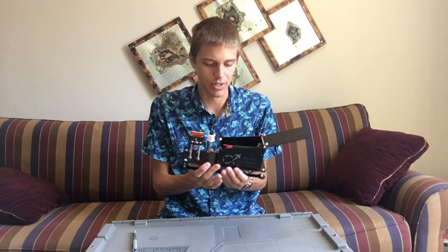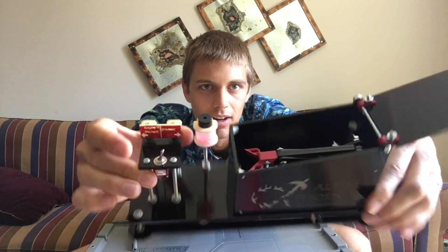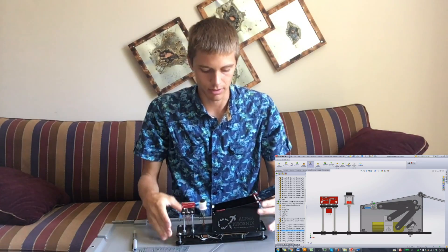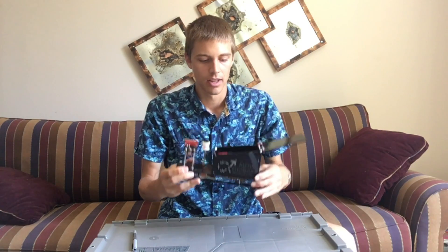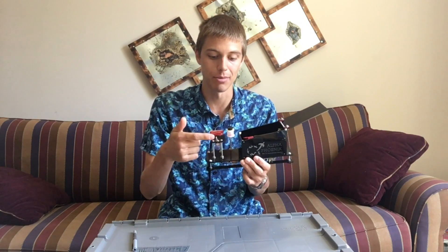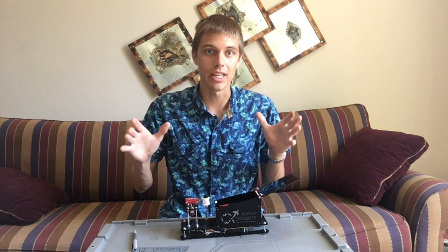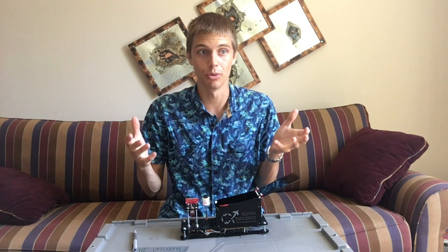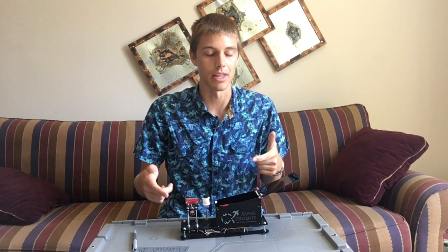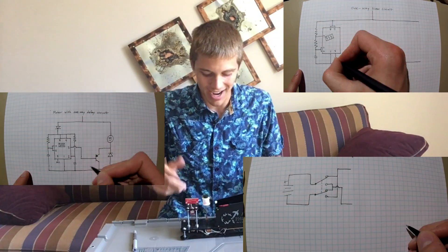The first big thing was that I wanted to make an articulating arm. The switch is over here and the box that holds the robotic arm is way the heck over there. It actually has to reach out — it's a four-segment arm that does the extension, with some sliding parts and some screws in there. It all runs from a gear motor on the inside. The other thing I wanted to do was add a little electrical complexity, but I did not want to add a microcontroller because I didn't want to wait for it to boot up every time you push the button, and I wanted it to be completely passive. If this is just sitting on a desk, the only power it's using is the leakage current backwards through a single diode — so it's reasonably efficient. I ended up complicating things with a whole bunch of 555 timers instead, and it came out real well.